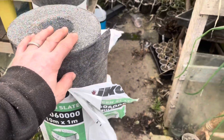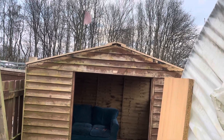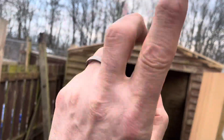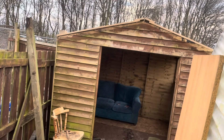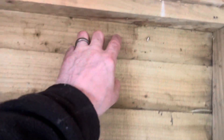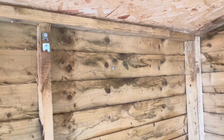I need to get a nice thick layer of coal tar on before putting the felt on. The felt is quite heavy — it's 10 meters, which works out to about three to three and a half meters wide. I'm going to put strips on the sides first and then a strip down the center. The water's been coming through — it's a bit damp in these corners. I'll use some of the tar in the corners and then I need to sort the floor out as it's started to dip down.